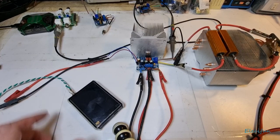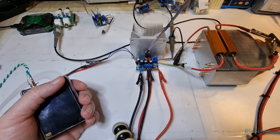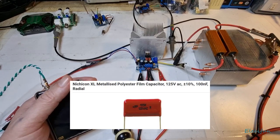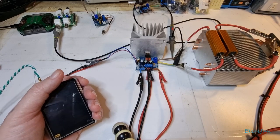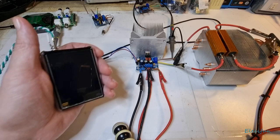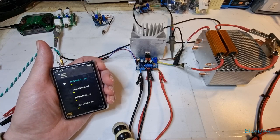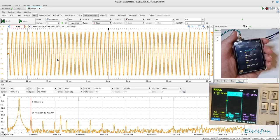Now we've got the second unit. This one has the CBB caps in it, and I believe these filter caps are Panasonic, this one Panasonic, this Panasonic, and this one Nichicon. The ceramics are still in here, including a 330pF ceramic at the back - I didn't have a replacement value for that. We're going straight in with the 0.1 reference. Not going straight to 25 volts in case there's a mistake in the setup - ramping up carefully, looking reasonable.